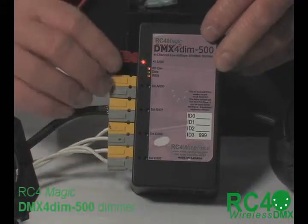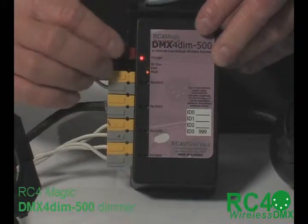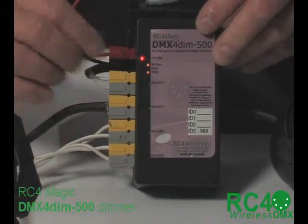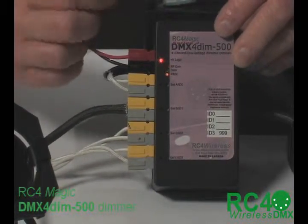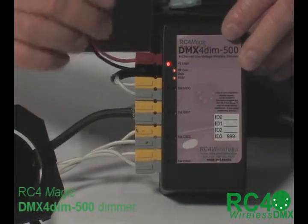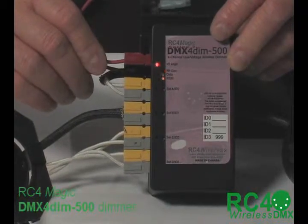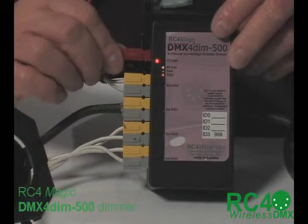So I want to point out Anderson connectors of this size have 3 pin capacities available. There are 15, 30, and 45 amp pins. And if you do the math for 500 watts at 12 volts, that comes out to 42 amps of power. So if you are running at capacity, you're going to want to use the 45 amp pins, some very heavy gauge wire, and quite a very large size battery.